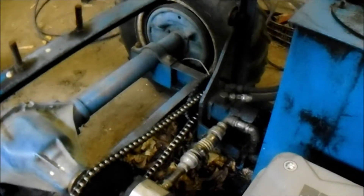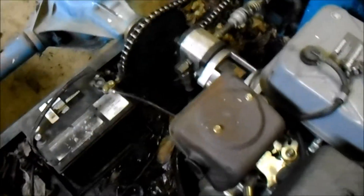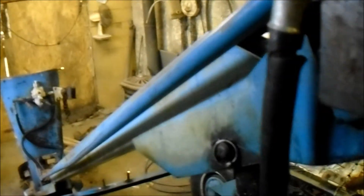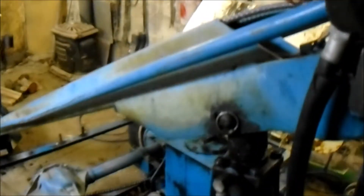You have your orbit motor over there — it powers the drive here. It's a very simple system with hydraulics, and the articulating tractor I'm going to build is going to be very similar to how this is operated. You have your controller and it's all by cable. The older ones actually used rods — my old red machine back from the 50s had that. Everything was mechanical then; more modern ones have cables. On the old machines a rod would be pushing things back and forth, very crude but very effective.